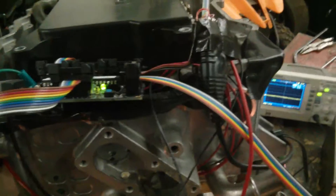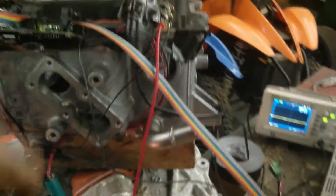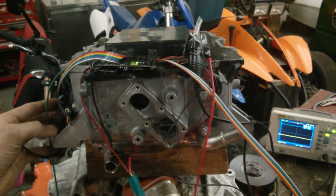So I'm going to push that button now. It's calibrated it. All the lights light up. It brings the RPM down. Now it's already calibrated and recovered itself, so it's already controlling where it is. Just give it some throttle — and there you go. It's now running in hall sensor mode. It's actually that easy to calibrate this.